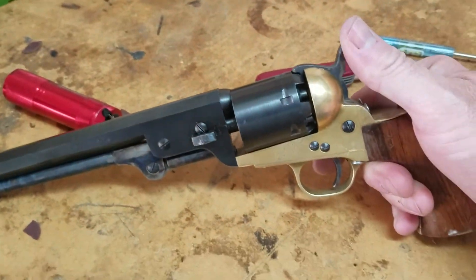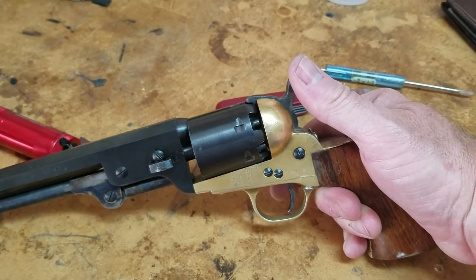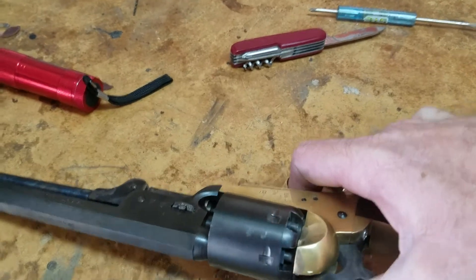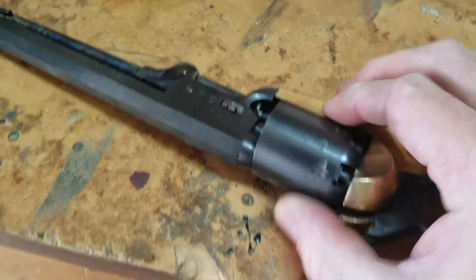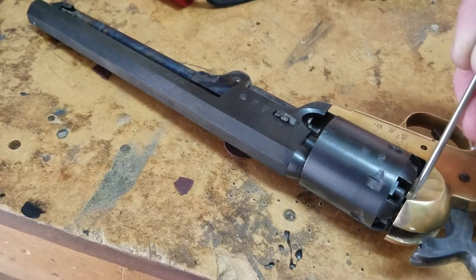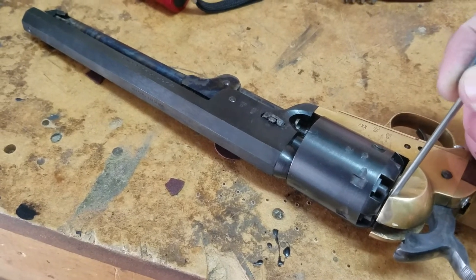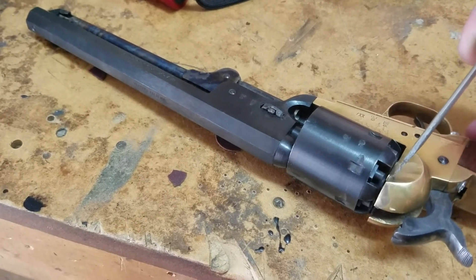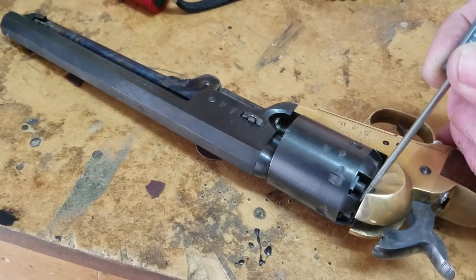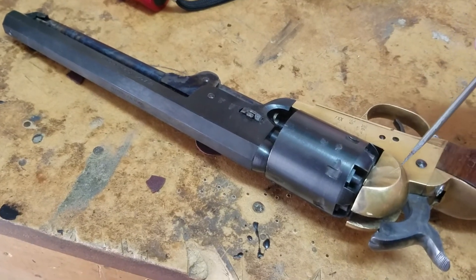So anyway, I've gone through three rounds of putting caps on here — number tens — and none have fallen into action. But what I did notice was as the cylinder rotates, the cap will start coming off right here and you'll get a little bind. So what I think I'm going to do is make this fillet a little wider right here, so if the cap does come off, it will have more of a way to fall out down this line.